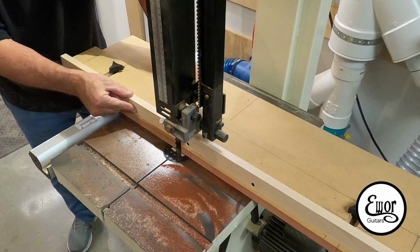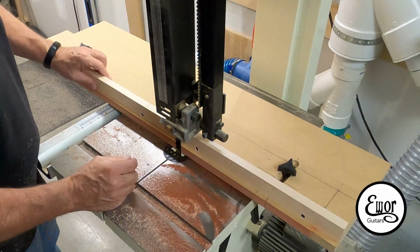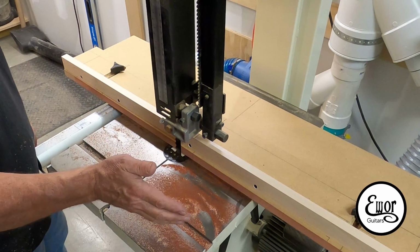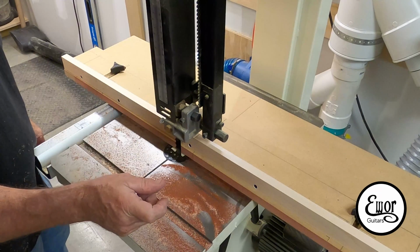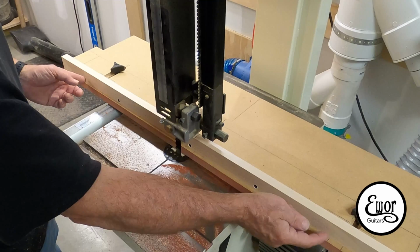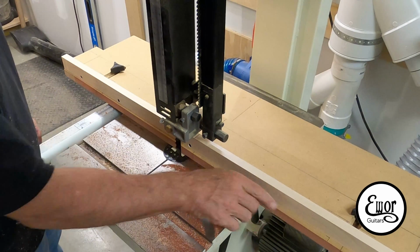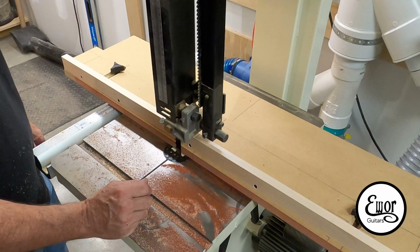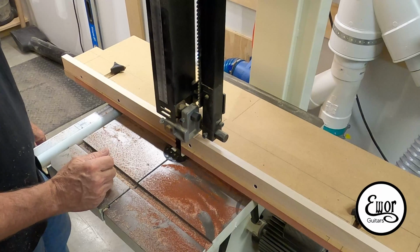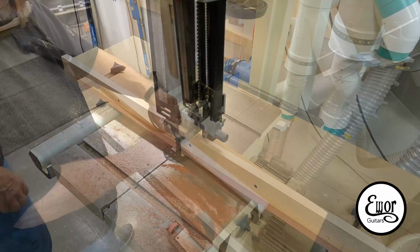And the fence is adjustable on these two guys right here. I can adjust the taper. And so right now I have that set on a taper for my 2 stripes and the center, the 2 red heart stripes and the center maple stripe. I'm going to sticky tape the boards to this fence right here, and they're going to sit right up on top here and run it through, and I should have a great taper. And then I'll just have to plane the edges smooth, of course. But anyway, this is what we're going to start with next.